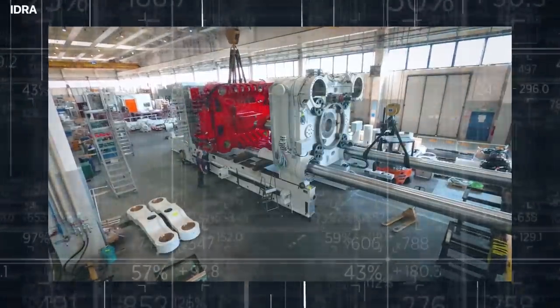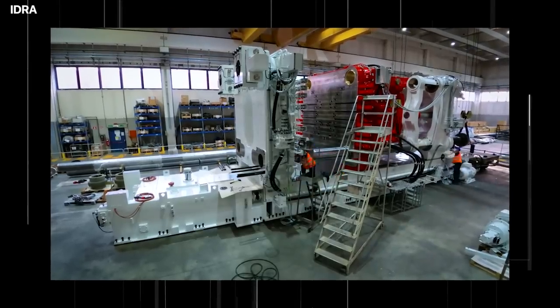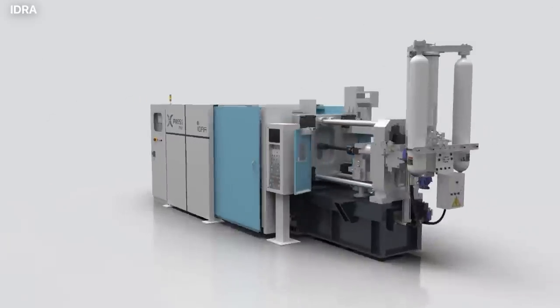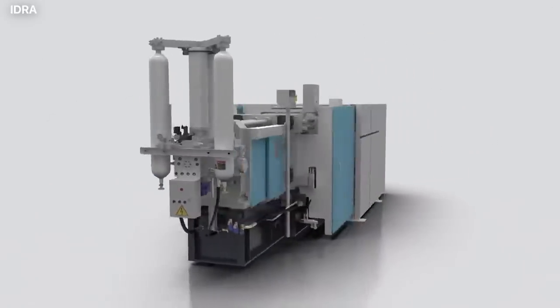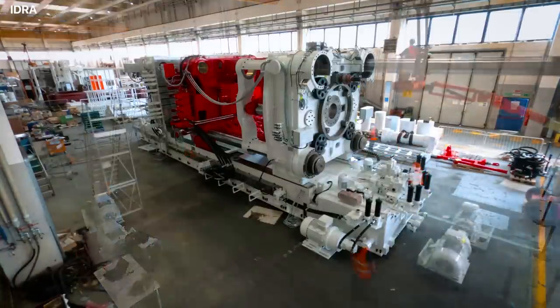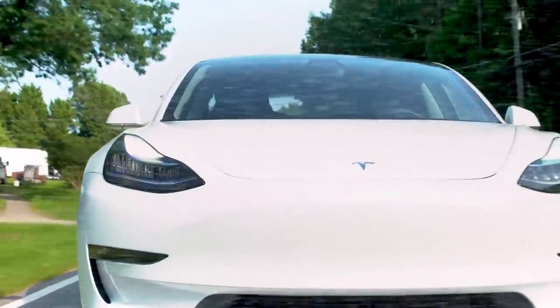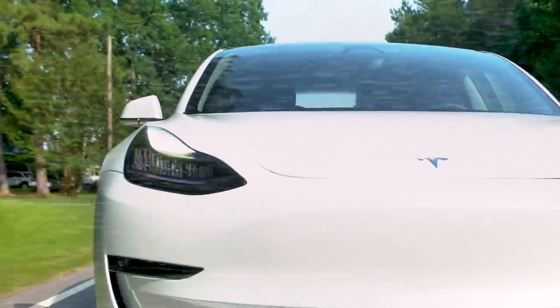The company acquired several units of the biggest casting machine in the world. These giant multi-million dollar machines are developed by Idra. The name Gigapress comes from the primary mechanism where shots of molten aluminum weighing 80 kilograms are injected into the cold chamber casting mold with a velocity of 10 meters per second, and the metal hardens into a frame section for a Tesla vehicle.